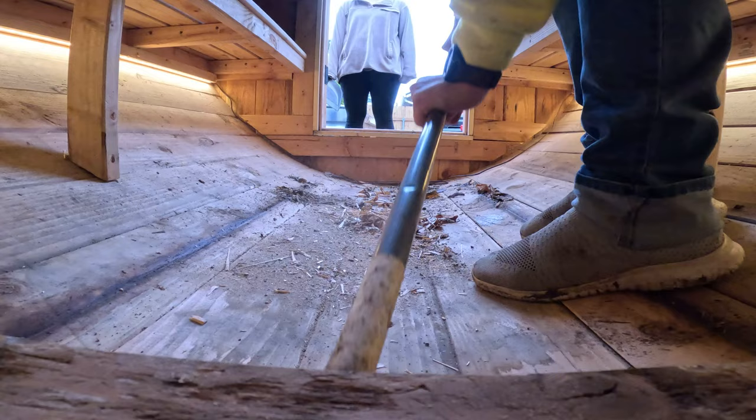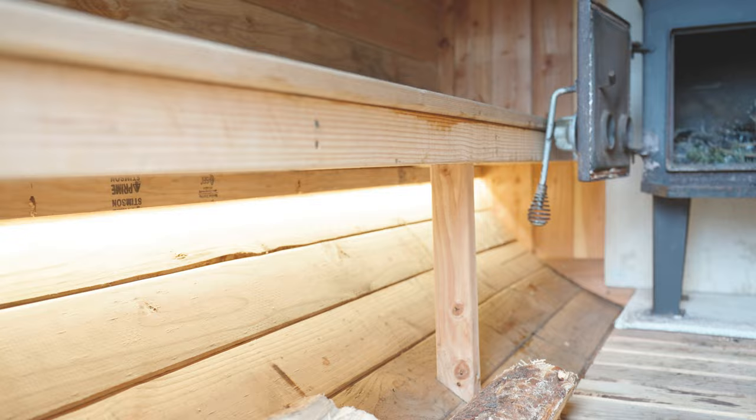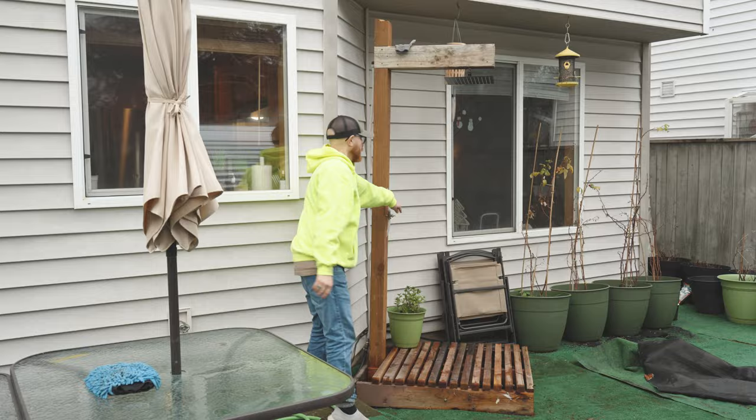A lot of you were interested in the fact that it's made out of pine — how's it holding up? It's holding up way better than I thought. I wasn't really expecting to have it for years and years. I just thought it would be a fun project to try building, and it was. Obviously there's shrinkage and gaps are forming, but I intend to line the inside with cedar anyway. For a sauna that cost me about $1,200–$1,300, I think that's excellent. Under the bench I put LED lights with a switch outside — super janky but it works. The only thing that's not pine in here are the benches, which are made with cedar on top. I'll post the dimensions in the description.